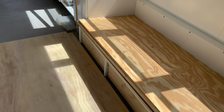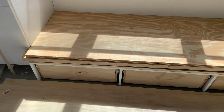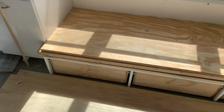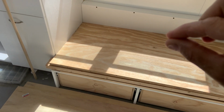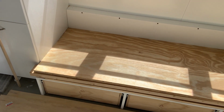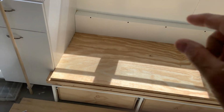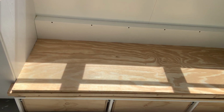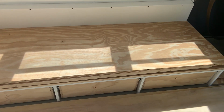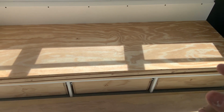The reason I went with 2 sheets, what was on my mind at the time, was I was going to go with 2 pieces of 3/8 plywood, and that would be 3/4 of an inch thick in the back where they're connected together. But I never really liked the idea because where I connect them together, they're going to be flat, and then it's going to change from flat to the angle. And it occurred to me last night that all I've got to do is bevel the end, and that takes care of that. Some of the airplane models I put together had a tapered piece of wood at the trailing edge of the wing, and the 2 pieces of sheet plywood were on top of that tapered piece. I can do it without that tapered piece just by tapering the pieces of wood.